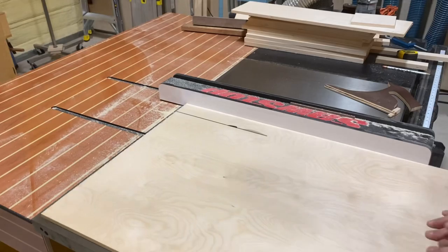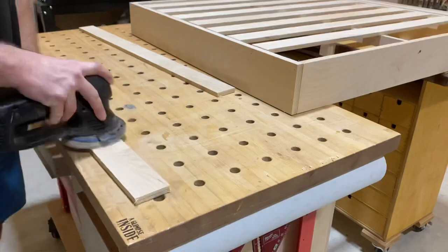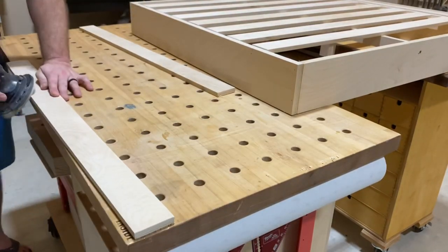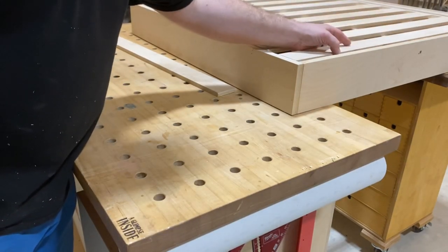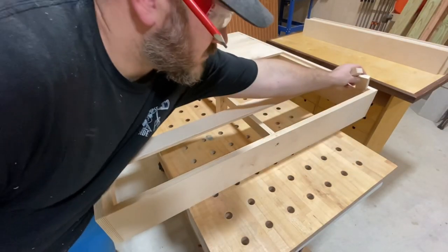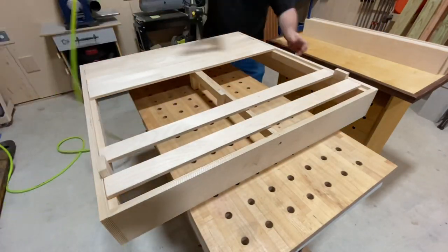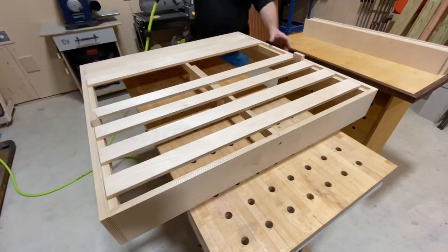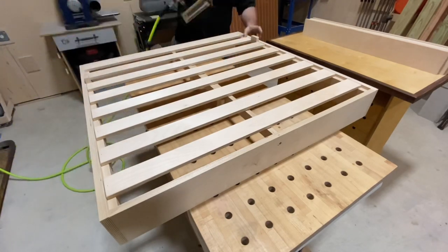With that process complete, now it's time to turn my attention to the table saw. With the half-inch thickness material, we're going to cut down two-and-a-half inch pieces and these are going to be the slats for the bed frames as you can see in the background. I'm going to make sure I sand these really well — I don't want any splinters happening to those kids in their bedrooms, even though they're going to be covered up with mattresses and sheets; you just don't want to take any risks. This process honestly couldn't be simpler — I got a small spacer block to evenly space these slats as I go ahead and brad nail them in place. No glue necessary here; the mattress being on this is going to be enough support as well.